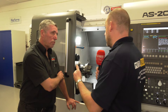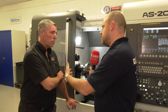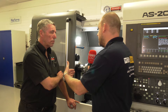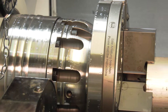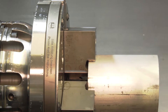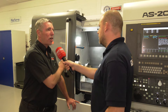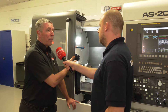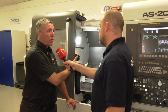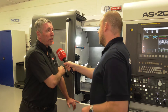We always like to look at both sides of the equation. If there is a disadvantage, it's that it's a much longer workholding solution, so you might lose a bit of turning length. Yes, it's about 50mm longer than the collet chuck itself. But with the mini chucks we have three different chuck lengths, so we can pick the shortest chuck length, and in the end the combined collet chuck and 3-jaw chuck are very little longer than a standard 3-jaw chuck.